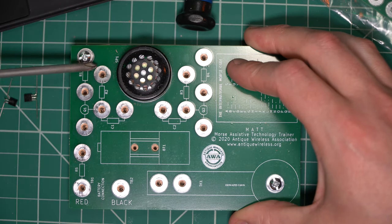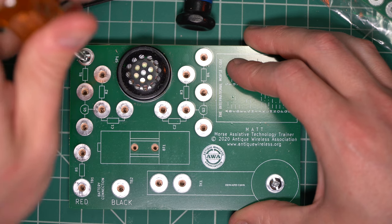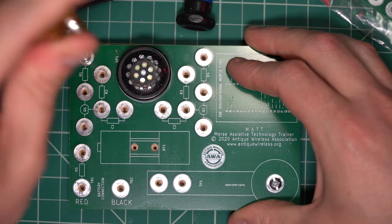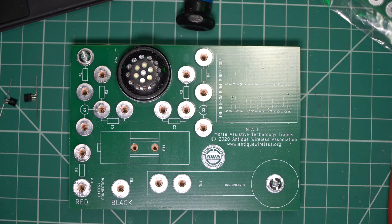You don't want to damage the PCB material, particularly the conductive area, and then back off 3 or 4 turns. So 1, that's 4 turns is a lot. So I'm going to go with as much space as it takes to get the wire underneath there. I'm going to elicit some help.